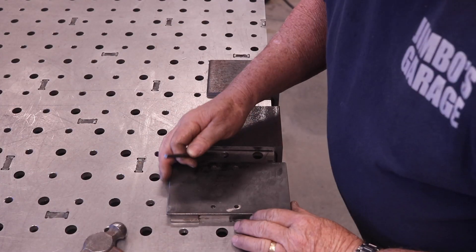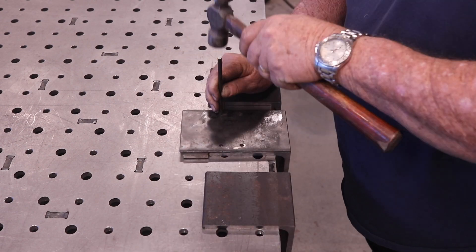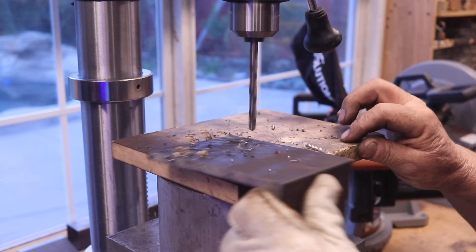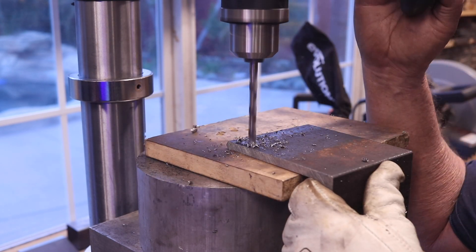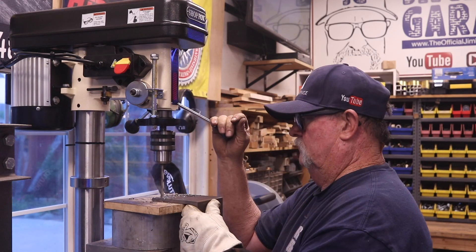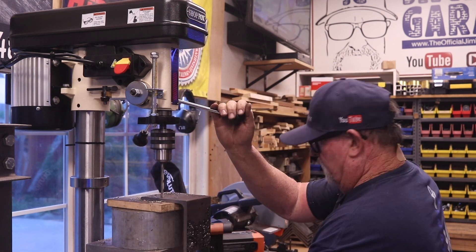The first thing I did was make a jig to get all the holes lined up across 100 pieces. I used a transfer punch to get those holes marked, then drilled them at the drill press. I went to KBC Tool and bought a pack of drill bits thinking I might burn them up, but with the right RPM and lubrication, that drill bit lasted through all 800 holes — and 800 countersinks as well. The old Ryobi drill press didn't quite make it halfway through, so I got the new Shop Fox to finish the job.